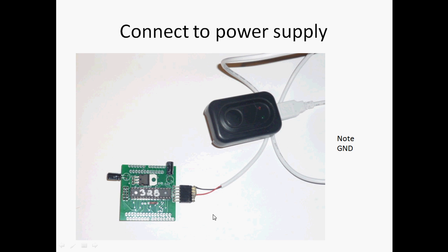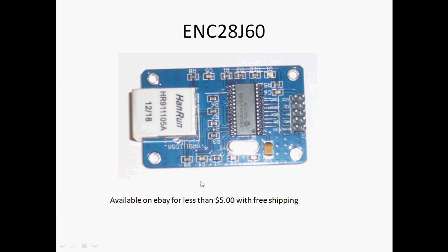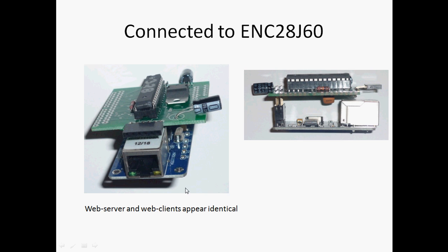This is how it looks when it's running, minus a couple parts. The ground wire is this one and the power is this one. The ENC28J60 is about $5 — this one has 10 pins, but some I'm getting from eBay have 12 pins. This one runs off a 3.3V line; the 12-pin one is a 5V line and has its own voltage regulator.